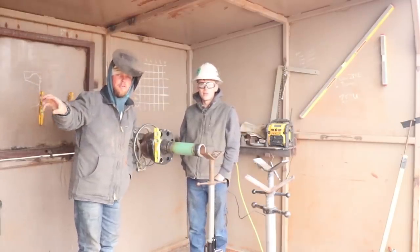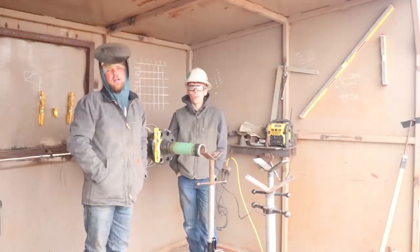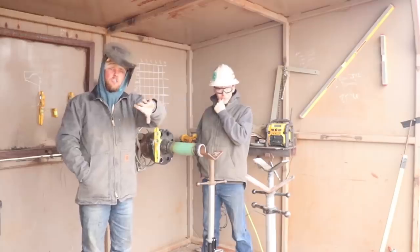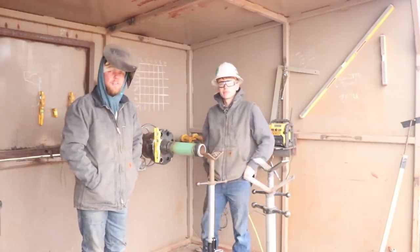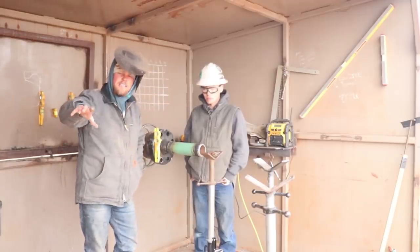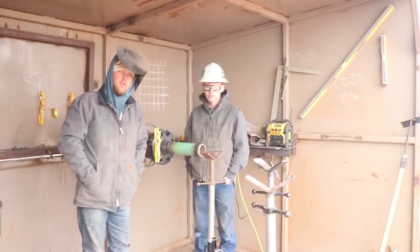Connor's over here welding right now so you'll probably catch quite a bit of his machine through the speaker. Right now we're getting ready to build a well head hookup. Basically it's a 1,500-pound 3-inch flange — a ring joint flange — onto a one-foot pup with a big sweep. The takeoffs on those sweeps are like three feet; they're big sweeps. We're going to show you how to get one leveled up. When you get out on the pipelines you'll be using 3R fittings — they're longer fittings and there are certain ways to get one fit up square.